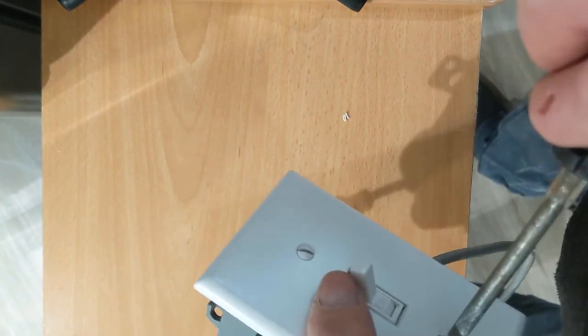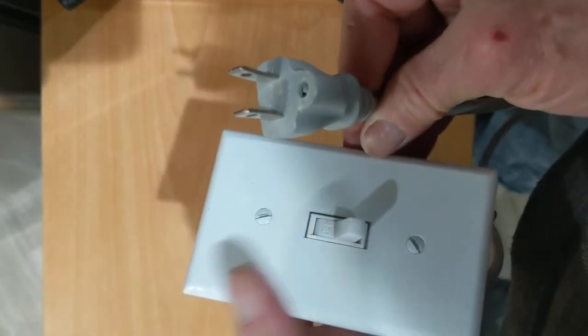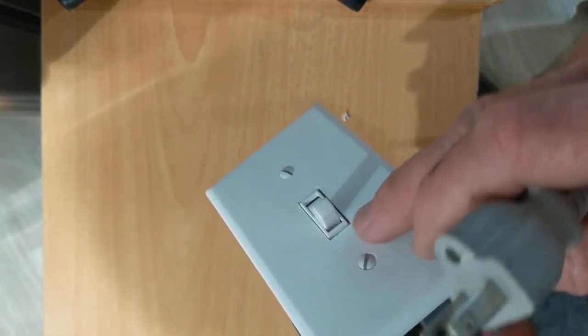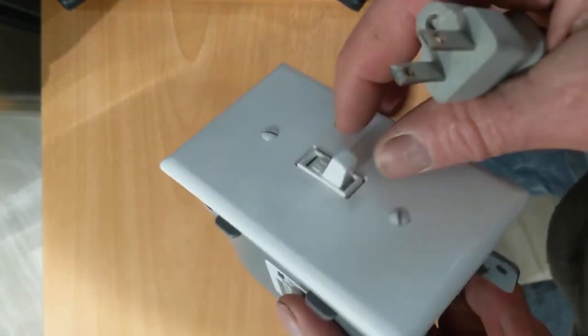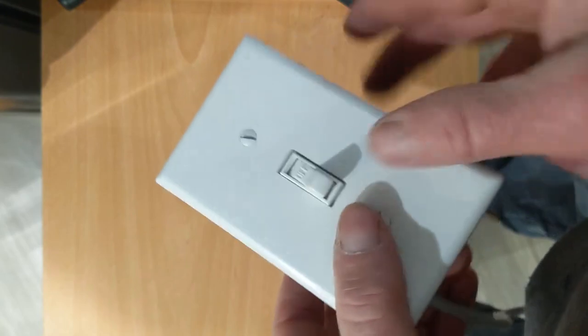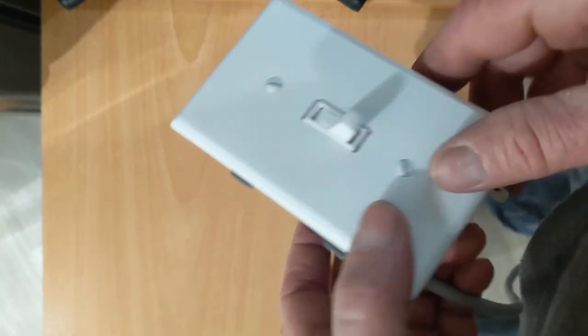All I have to do is test it. I'm gonna plug this guy in, then I'm gonna switch the switch, and then the breaker would go off — and then I know which breaker it is. I can show you here, but it's not here that I need to use it — it's on the job site where we just replaced the panel. I think it needs labeling, so I need to go around and figure out which plug goes with which breaker, then label everything up.